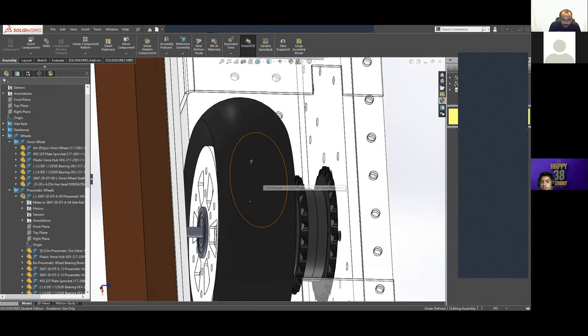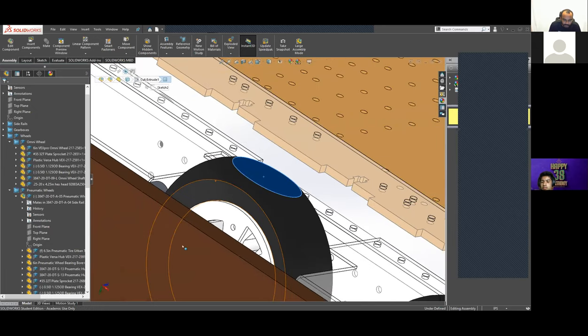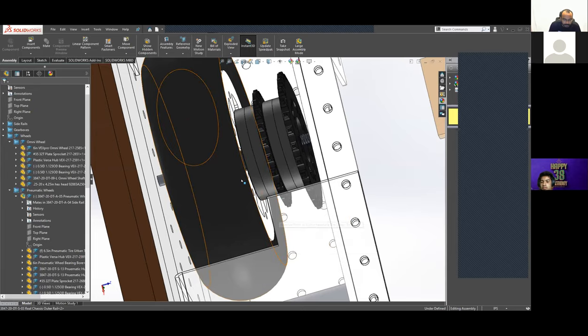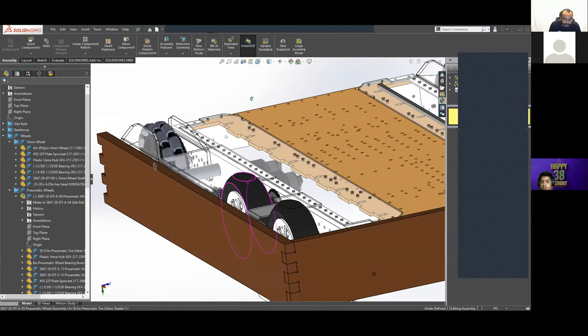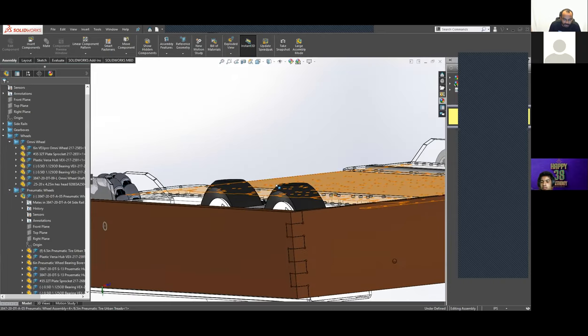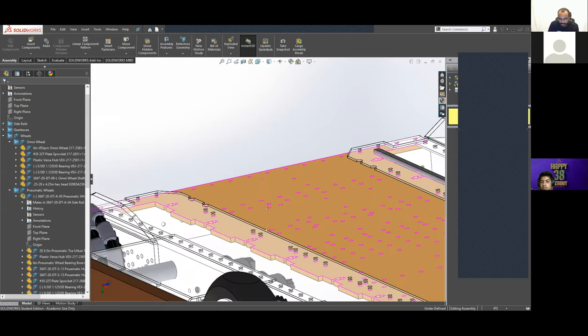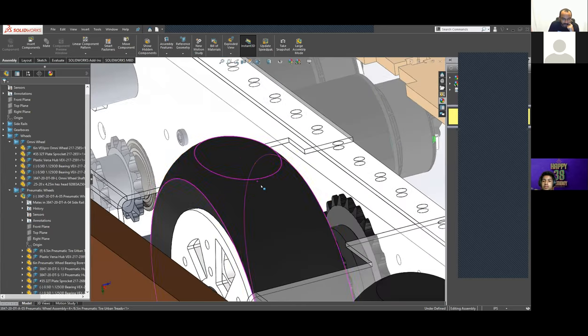That's why we have it cut out for the wheels to be flat on the bottom, whereas on the top we needed to design to have the space for 6.5-inch wheels, but the bottom really didn't. That's one of the big advantages of the pneumatic tires, especially these ones: you can get a nice big contact patch that's a lot larger than any of the other treaded tires, because they don't deform as much as we can get the pneumatic tires to.